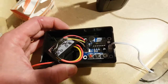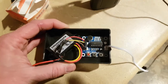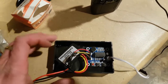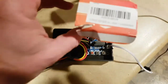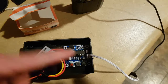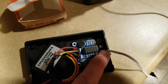It's meant to be used with an Arduino or Raspberry Pi setup, but you can program it however you want. In this case, we're just going to be controlling it manually. It's ideally run at 3.3 volts, but it can also run on 5 volts, which is much easier. This is the recorder module from Amazon. It comes with a little speaker, which we won't be using, but that's what's meant to connect to the white leads that come out of this side here.